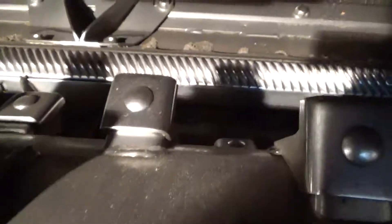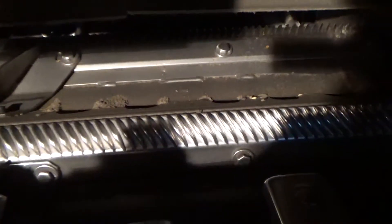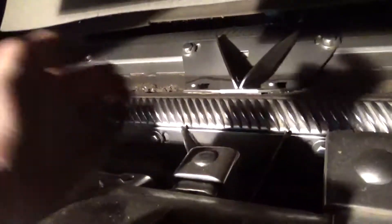After the grain and all the material comes up through the feeder house, this is the APS drum that starts the threshing — it helps with threshing. After the APS drum, you have the main threshing drum back there, the biggest one. These are called rasp bars. Each one angles a different way to keep the crop moving and rolling, which just helps it thresh better.